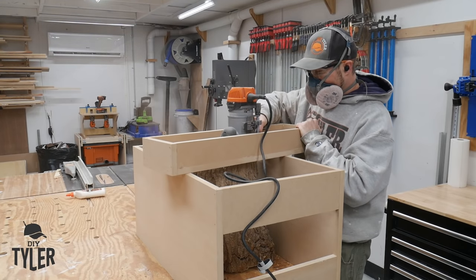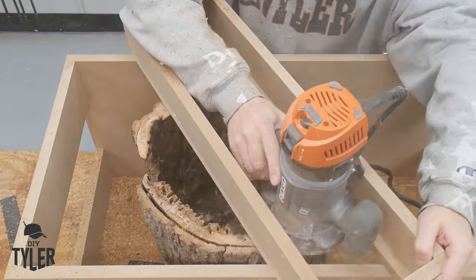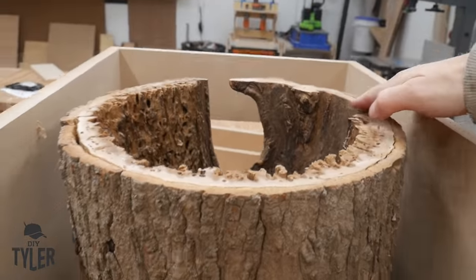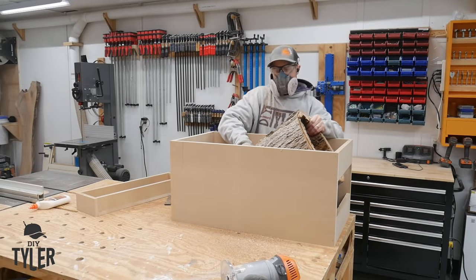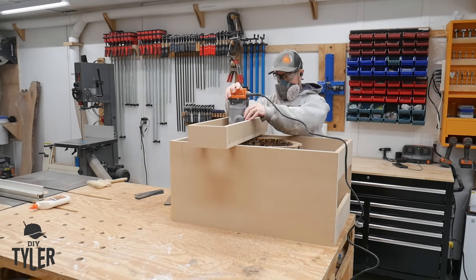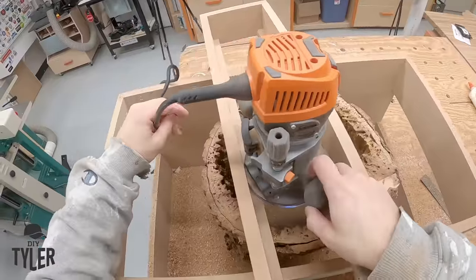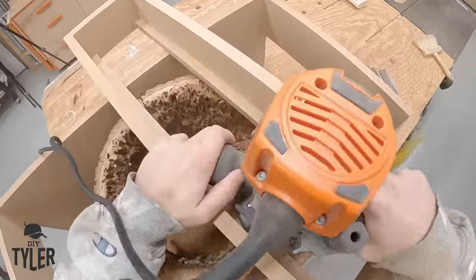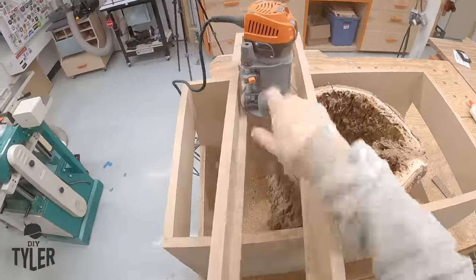Be sure to spend plenty of time cleaning yourself up and your shop afterward. As you can see, with the frame we built around the stump, we're able to slide the router around and shave off that top portion perfectly flat. I did about two passes on each side so I wasn't taking away too much material at once. I didn't have the stump fastened down — just gravity and the shims held it flat. Once the top was flat, we flipped it over, removed the shims, and flattened the opposite side, giving us two sides perfectly parallel. Same concept applies to flattening a big slab.